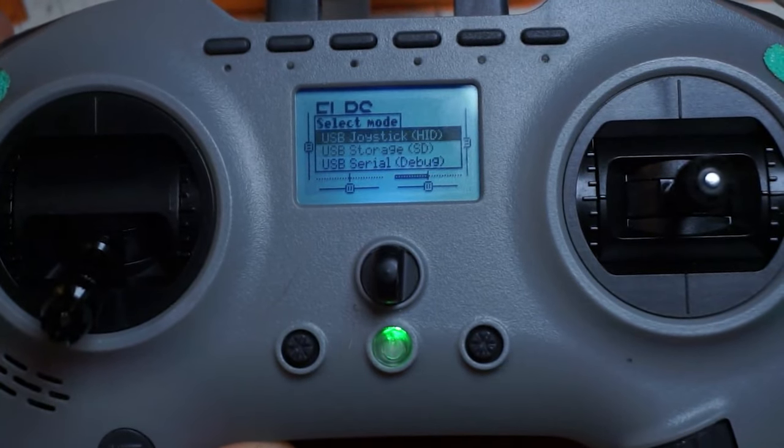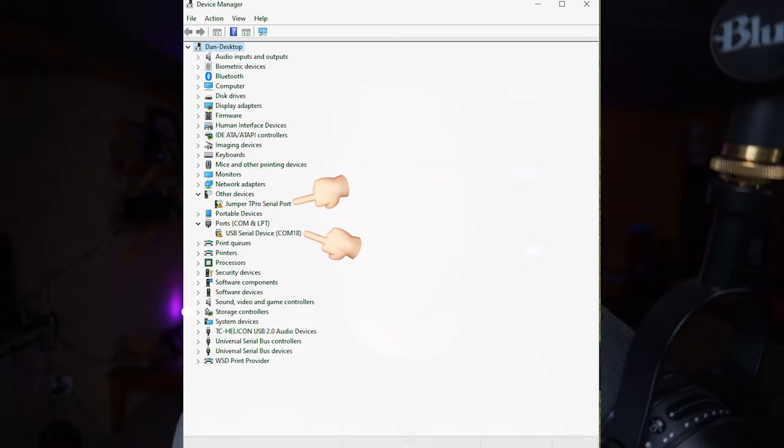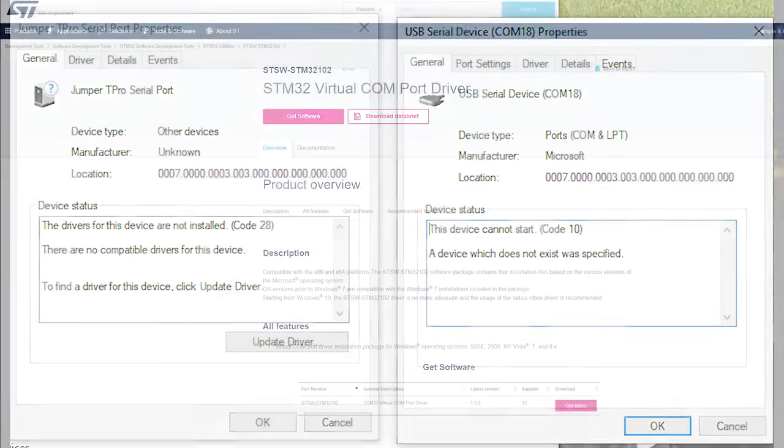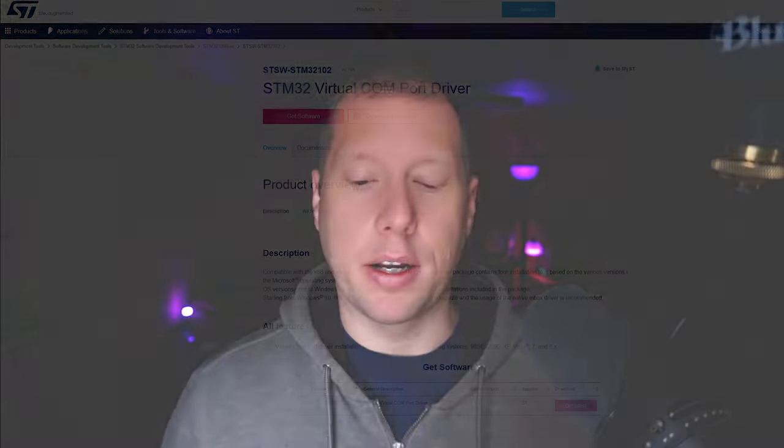Now that we have all the software downloaded, I've installed that jumper wire from the boot pad to my right momentary button to make this easier in the future. With the EdgeTX bin flashed, connect the USB port and go down to USB Serial Debug. Give your computer a couple of seconds to recognize the radio and load the drivers. If this doesn't work, right-click the Start button in Windows, go to Device Manager, and check for driver issues. The fix is going to STM's website and downloading the STM32 virtual COM driver. This is why I really recommend the FTDI update — it's a surefire thing with no messing around.